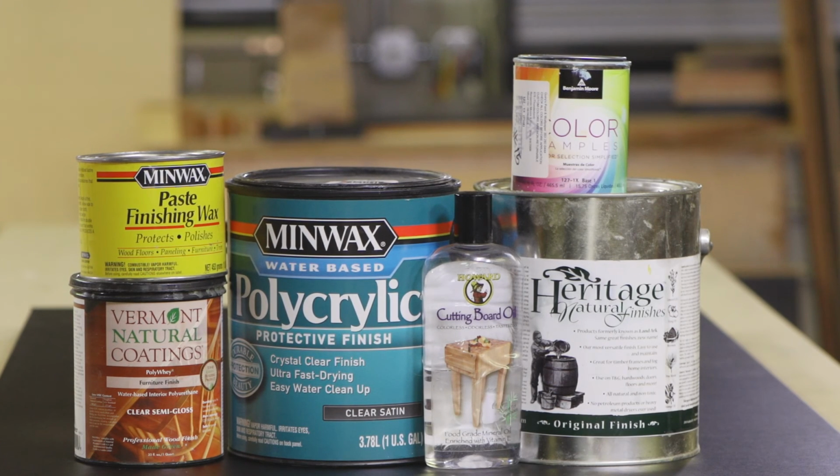Many finishes have been used successfully by fabricators and installers. Richlite can be painted or finished with most wood or stone finishes. Teak oil, urethanes, and stone finish products have been used by customers with success in the field. Mineral oil can be used as a finish, but requires frequent maintenance.